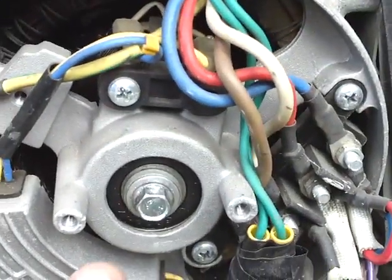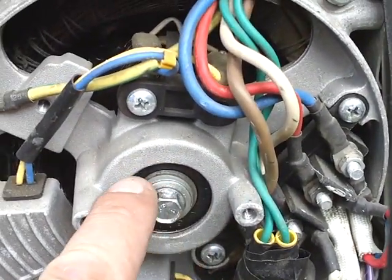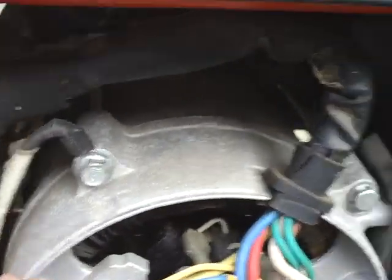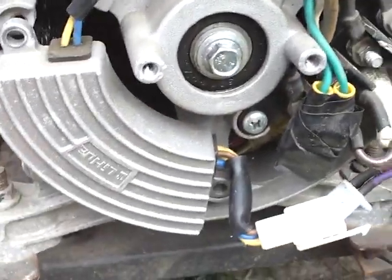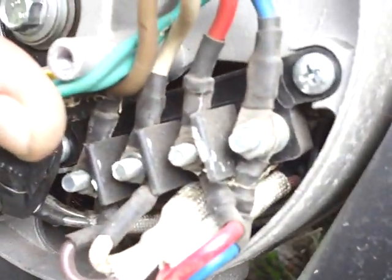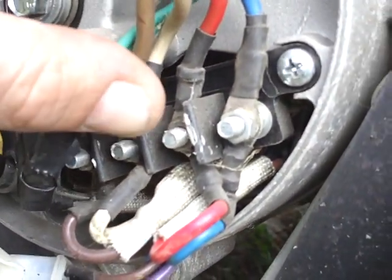There's the business end — there's your bearing right there in the center. This end bell comes off with four bolts, one in each corner, and everything unplugs. There's your terminal block for L1, L2, L3 — it's got four posts. It's a pretty simple generator to work on, and as you guys could see in my last video, it's pretty super quiet.